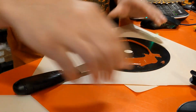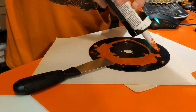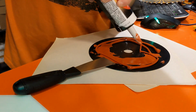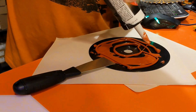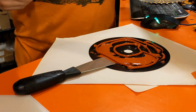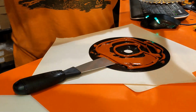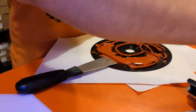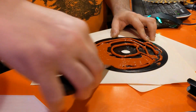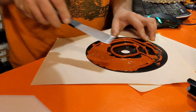The reason for the silicone is because there isn't actually all that much space between the sectors on the disc. Quite a bit more than I originally thought, actually, even. And so if you want to get everything to not short circuit, and you want to be able to get all the voltage that you want to get, and you want to maximize your surface area while still using sectors, then you need some way to prevent the machine itself from short circuiting. My solution to this is silicone. And we want a nice good little coating all over this wheel here.